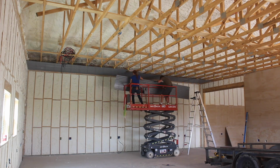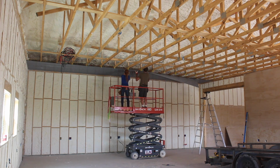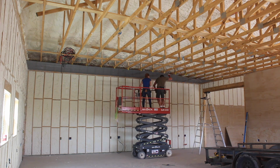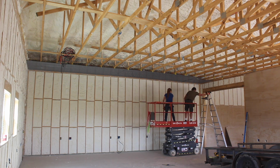I contemplated trying to do this step off ladders, and thank goodness I was talked out of it. These panels are light, but it was still an extreme 3-day workout putting up the ceiling, and the scissor lift was 100% worth renting. The panels are 14 feet long and around 2 feet wide. I started at the back of the building so that when entering the shop through the porch, I won't see the side laps. Then I also started at the left of the space so that the head laps will also be mostly hidden when standing at the same spot.